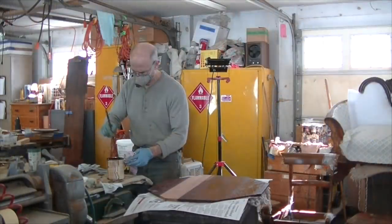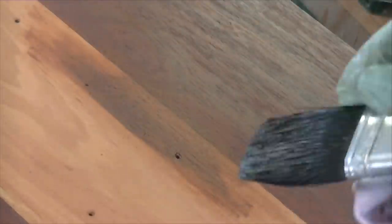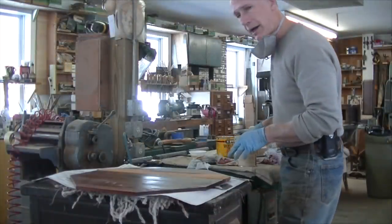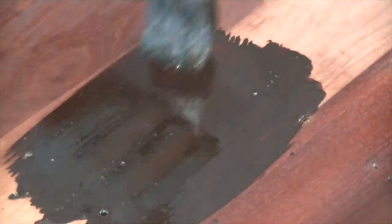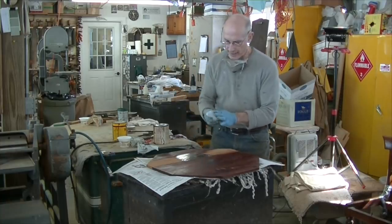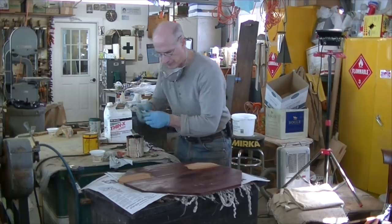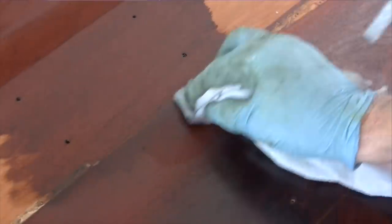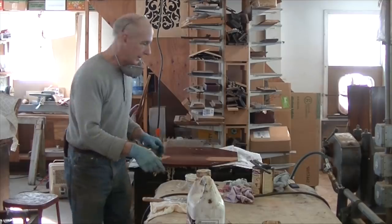I've got a stain I like a lot — brown mahogany. This is a fast-drying stain. That looks really good. This brown mahogany stain looks great. I'm going to do this middle section of my sample, let it dry and put some finish on it to see what it looks like. I'm letting that set for a minute or two, then I'm going to wring the rag into a pad and just pat it off. I'll dip the corner of my rag in a little paint thinner and go along the outside of my line.